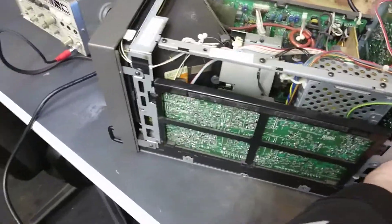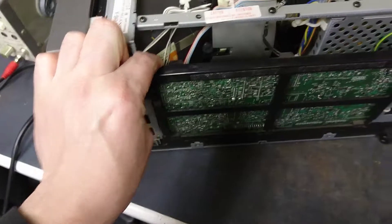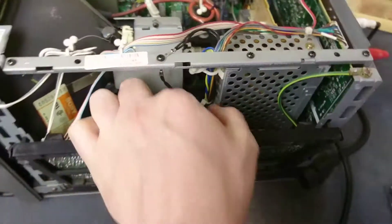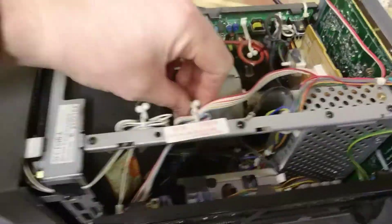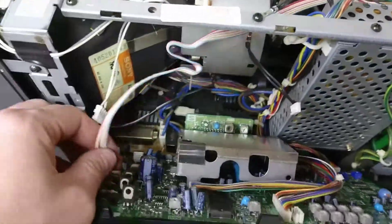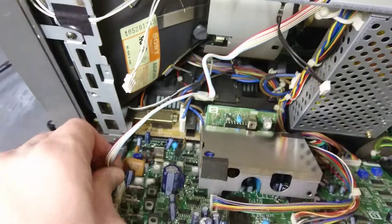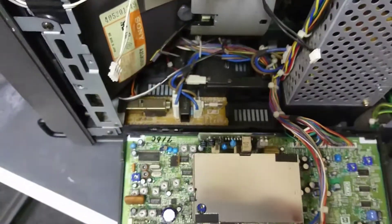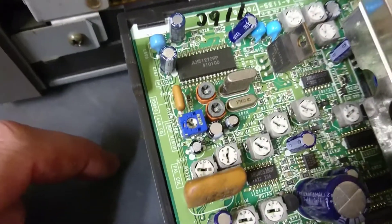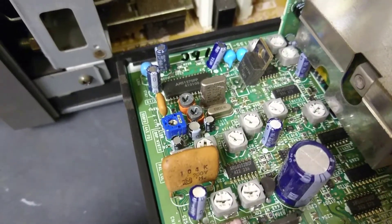It'll be worth turning it off at this point. Carefully unhook the circuit boards, unplug your connector. You can undo these little cable twist things. Unplug the coils — this is the tube base cathodes. And the two offending trimming capacitors are these ones down here. As you can see, they're the originals, so I shall whip both of them out and change them for these blue type.